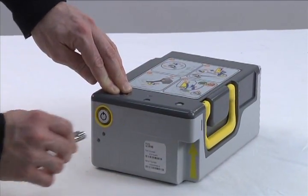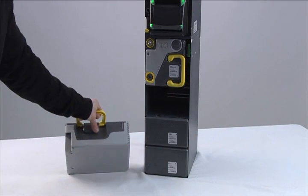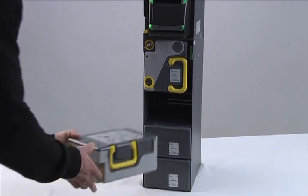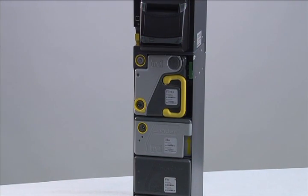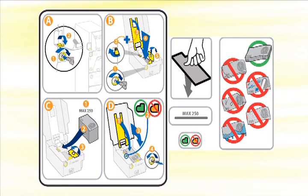This ensures the loader cassette is properly closed. Put the loader cassette back into the BNR — please note that the handle must be tucked into place. Push the interlock lever and turn the key counter-clockwise to activate the interlock system and remove the key. This secures the loader cassette. MEI has created labels to provide visual aids when operating the BNR — please consider their use when placing the unit in the field.